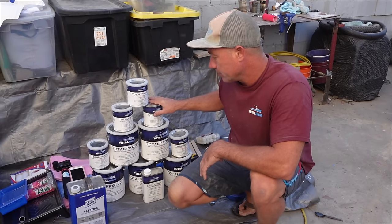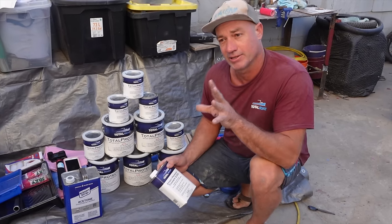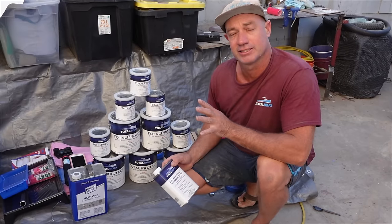It's a very important part to keep the boat nice and dry and blister-free. It's a two-part, so we'll be mixing this up. There is a thinner which we'll probably use to thin down the first coat, just to make sure it gets into all the little cracks and so on.